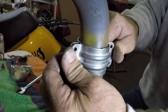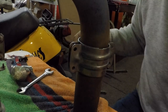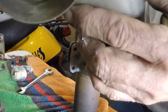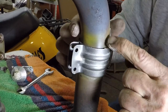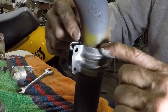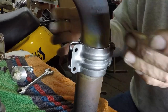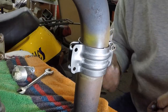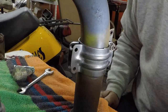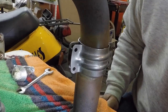Now we can line it all up. We have to line this one up carefully because we do have to keep in mind that we have this to go back on. The Walker Acoustical Seal allows us to slip and slide so when we come to put these back in and tighten them down, everything moves nicely together and bolts together without any problems. We hope you found that useful and informative. Thanks for watching Grumman Pilots YouTube channel — have a good day flying in Grumman.